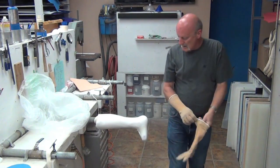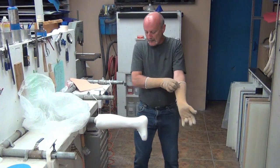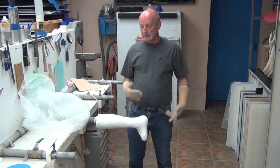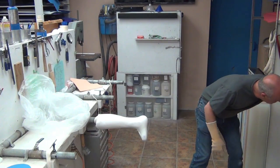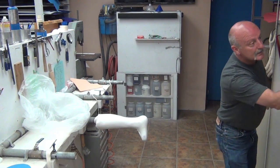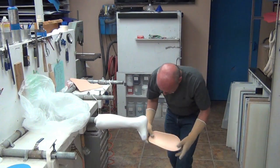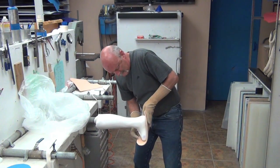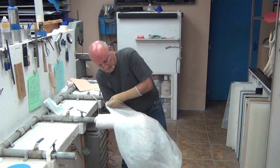We're almost at two minutes, so we're going to go through vacuum forming of the first layer of material. Hopefully I get this right the first time — if the video is continuous I got it right; if it's cut, then you know I missed. It's probably a more successful pull if you have two people, but it happens to be the weekend as you can see by my attire. I use a piece of material about two inches outside my trim lines and line that up.